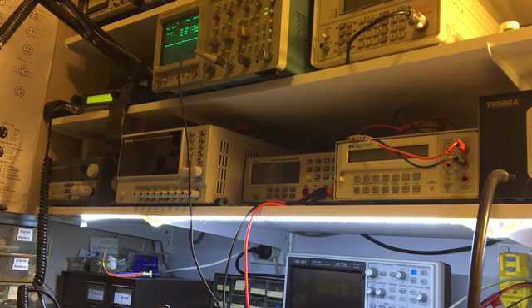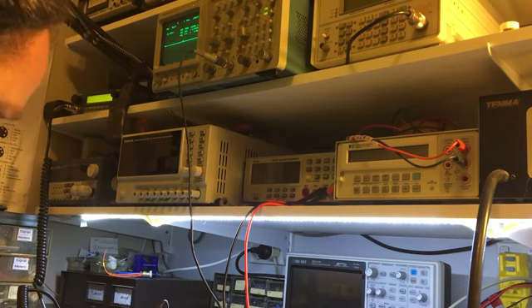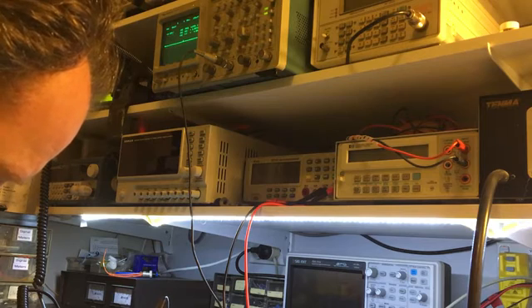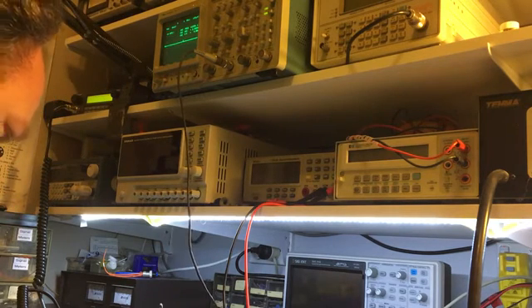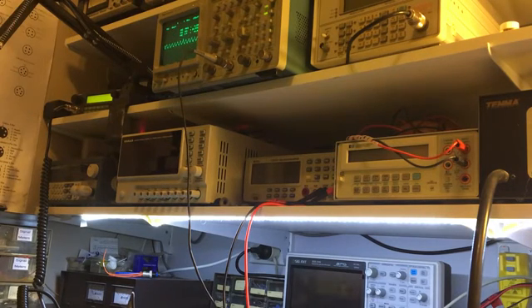This has been worked on before. There's no microphone so I'm just having to short the terminals out, which is not ideal. So that's on transmit now. This is the pre-driver input — it's about 38 millivolts peak to peak.